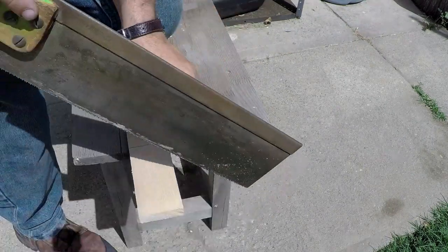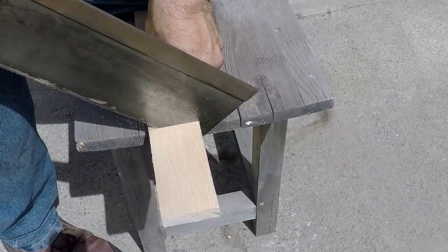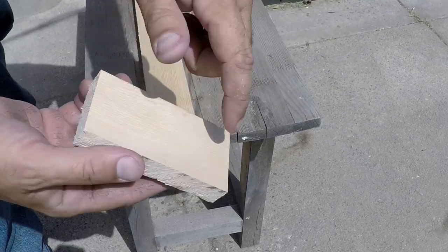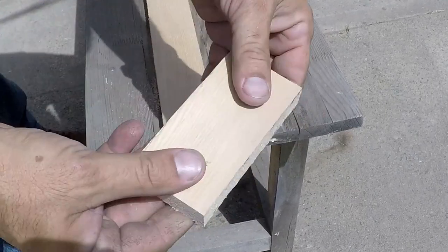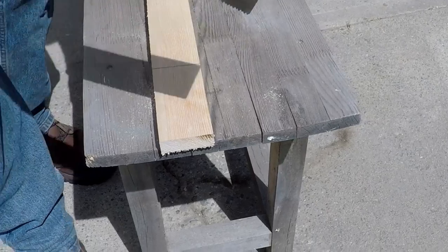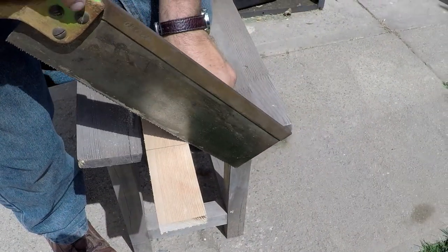Let's slice this one off — we're going to make two of them just the same, I'll spare you all the details. You can see we're using some second-rate wood here, but this is the side that really matters — this side out here. I'll probably fill that with a little bit of putty just to make it flat, so we need two of those. Precision is not preeminent right here — the only surface that really matters is where it mates to the end of the core box, and the top surface should be nice and even.